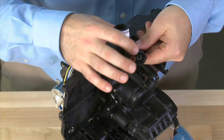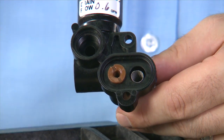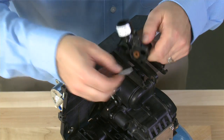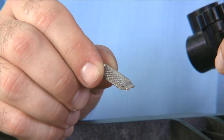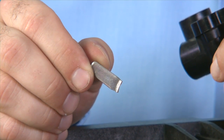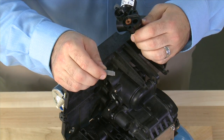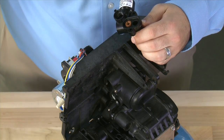This gives us access to our screen and two-piece 1600 injector assembly. We can remove the screen by pulling forward or tilting it to the side. The bottom end should be welded and sealed in order to make sure that the water has to flow through the screen before going to the injector. If this is built up with debris, we can use warm water and a soft brush to clean it. We recommend replacing it if the debris cannot be cleaned.